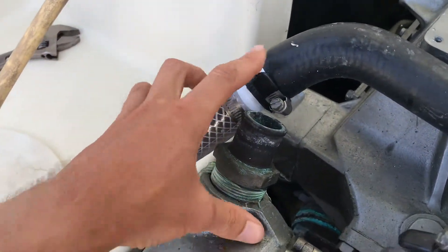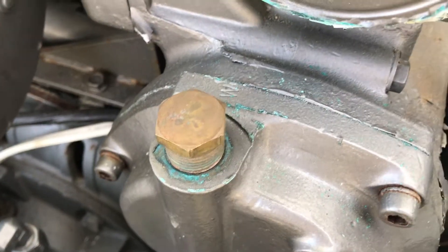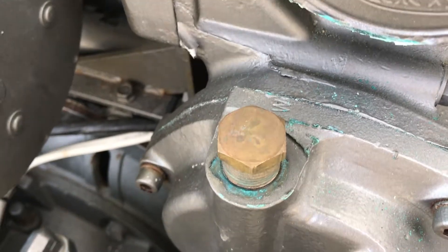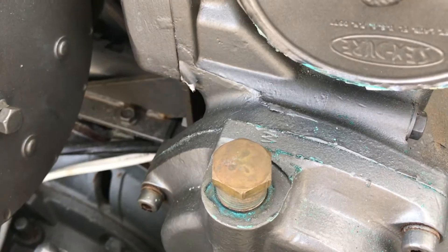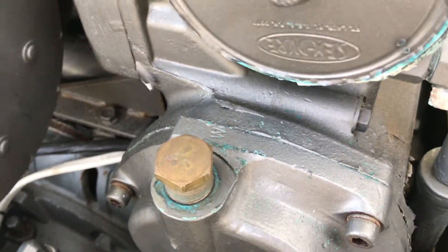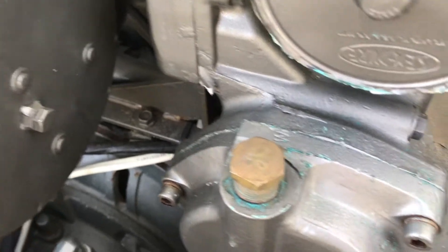Here it's an inch and a quarter. If you just replaced your zincs, they say it's better to remove them because the product will dissolve them. In our case we left them in because we had to change them anyway. We had four zincs we could take off easily, but four of them were stuck — we hoped they would dissolve so we could put new ones in afterwards.